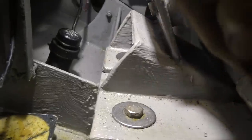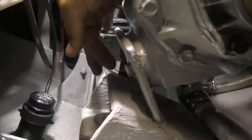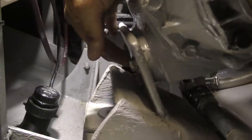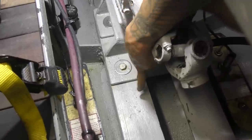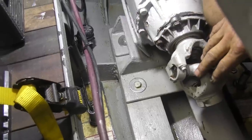The other part of the problem is it was loosening up the bolts we mounted down here at the bottom. This is a big angle iron frame that we welded into the frames of the boat, and we built this bracket that bolts into the transfer case — but these bolts keep loosening up. They're in holes that go all the way through into the case, and when they loosen up they start oozing oil out too. We've actually had a fall away, so we're going to take the transfer case out now that I got the top brace done and just weld that bracket to the transfer case, because that bracket is bolted into the frames on the floor. We can still remove it; we'll just make it part of the transfer case.